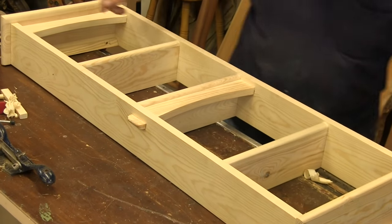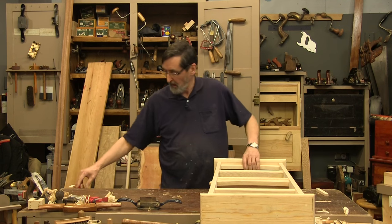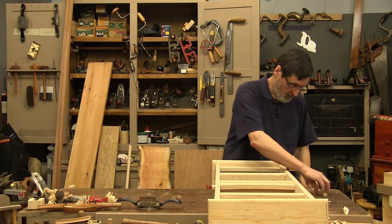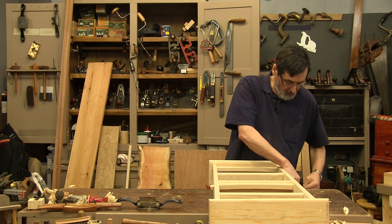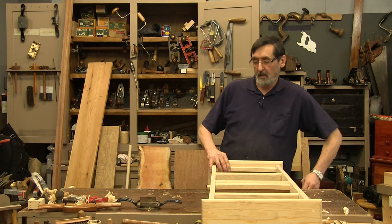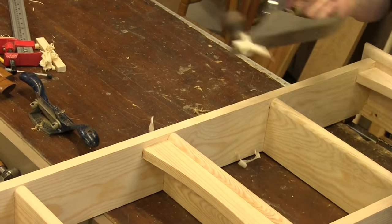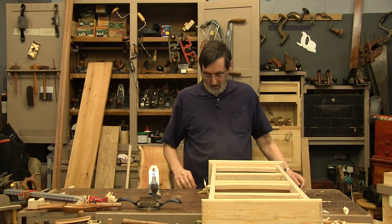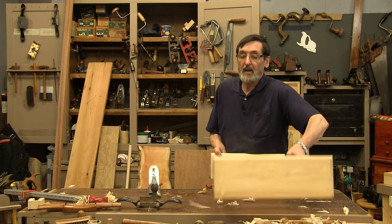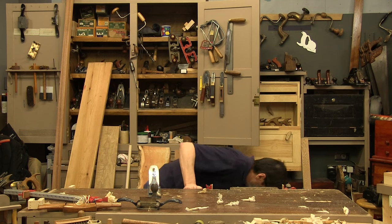You could also go across your workbench again — this makes your workbench very versatile. Bring in your jaw, a little shim in here — this quickens up the process. You don't even need the spacers just to cushion your work; you could also use them to fill the gap and speed up the process. So here I can work on this edge. This works perfectly for 90 to 95% of your clamping needs — I think 95% of your clamping could be done with this clamp-in-the-vise system.